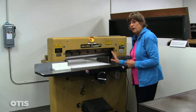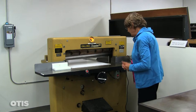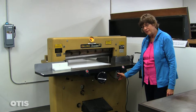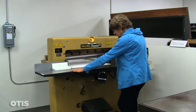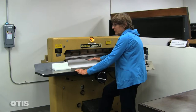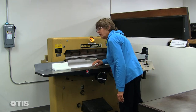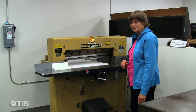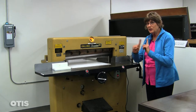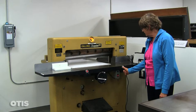I'm going to run through all the steps first because it's quite noisy. One of the first things I do is turn the start button — the green start button — on. Then I get balanced and put my foot on the treadle. The toe pushes down the clamp, which comes down on the stack of paper. I release, check to make sure the paper hasn't joggled, and now I'm ready to cut. When you're ready to cut, remember it's very safe, especially if there's only one person back here. Put your right thumb on this red button.